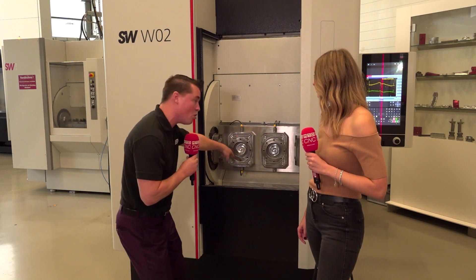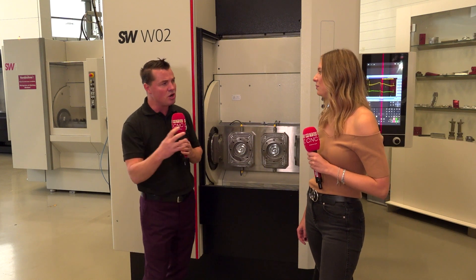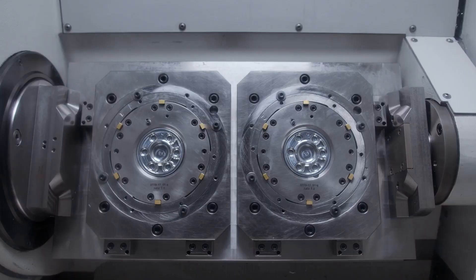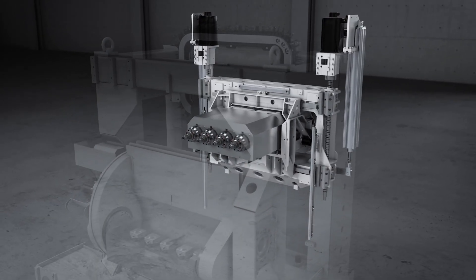How much time do we often spend on load and unload time? When it comes to quick programs, oftentimes a program will be five minutes and the load and unload time will be five minutes as well, so having the ability to do that simultaneously is important. We can also talk about the speed of these machines — we're doubling up by having two spindles, and now we've added speed. We add speed by having a linear motor; the W in this machine stands for linear drive. A linear drive is automatically magnetic, has low wear, is way faster in the box-in-box unit that's also in the machine, and ensures positioning while keeping up speed and having high dynamic overall.